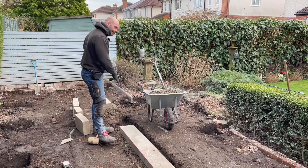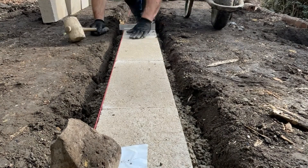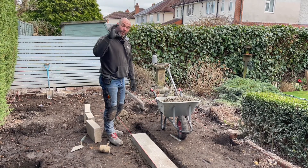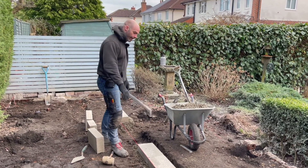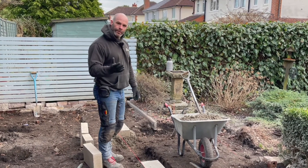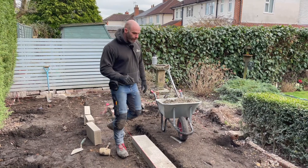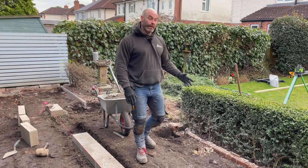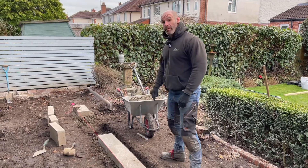I've got a few of these concrete blocks in now. We used the laser level to set the depth of the trench — we found the height of the blocks, added 200 millimetres onto that, and that allowed us to dig the trench at the right height. That means we've got 100 millimetres of concrete underneath the 100mm thick concrete blocks. The blocks are going down straight on the wet concrete, a little bit like laying curbs, so this whole thing will go off. Concrete on top of concrete just makes more concrete, and it's this that's going to be supporting our frame. All the joists are going to be running across this way, so we've got some other pads dug out — they're going to have concrete and concrete blocks in, and they're going to support the perimeter joist.